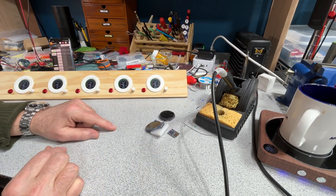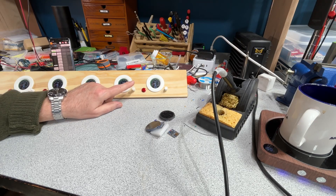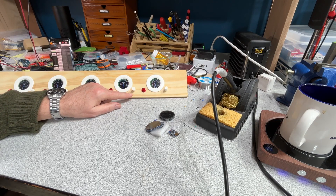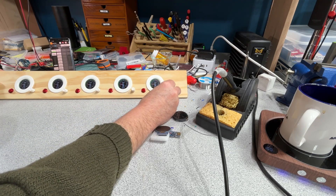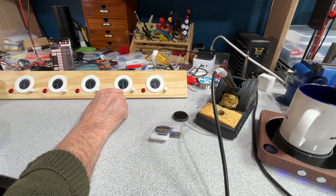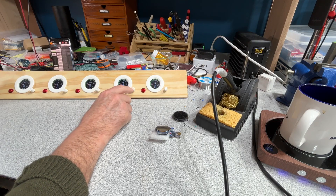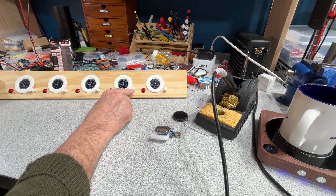For under $16, and then there's the encoder knob and button. You can get these encoders for $1 on Amazon as well, although I think I'm going to change these out — these are the super cheap ones from Amazon. They work okay, but sometimes the detent doesn't fall right where it's switching, so you get sometimes two counts, sometimes one. I think if I bought the better ones from DigiKey or Mouser — the original company was Bourns, I think, that developed these things — they're like three and a half bucks. Pinching pennies on something so stupid, right? Just buy the better ones from DigiKey.